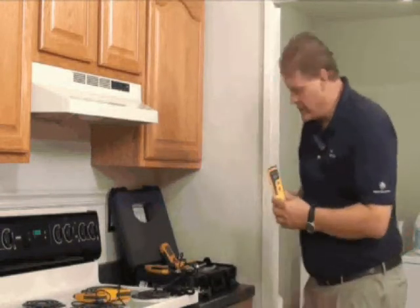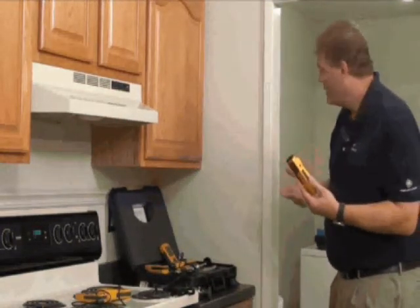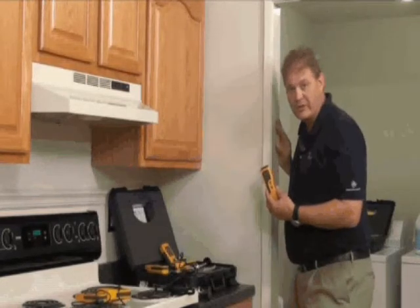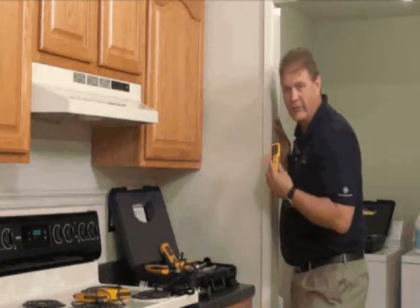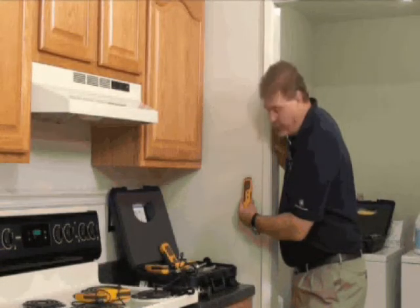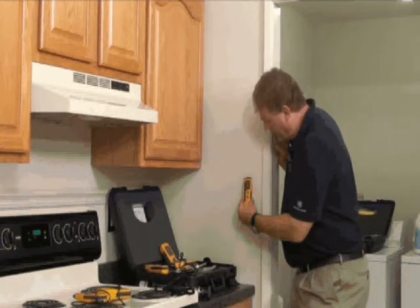Simply turn it on, and we can check that it's working by just placing our hand on the back here. Now you can use this on a wall surface to look for moisture below the surface. It's not adversely affected by surface moisture, so if you have a thin film on the surface, the meter is not going to give you a full-scale reading. When we place it on the wall, you just want to tip the meter up so that the top of the cap hits the wall, and that gives you the appropriate angle for a reading.